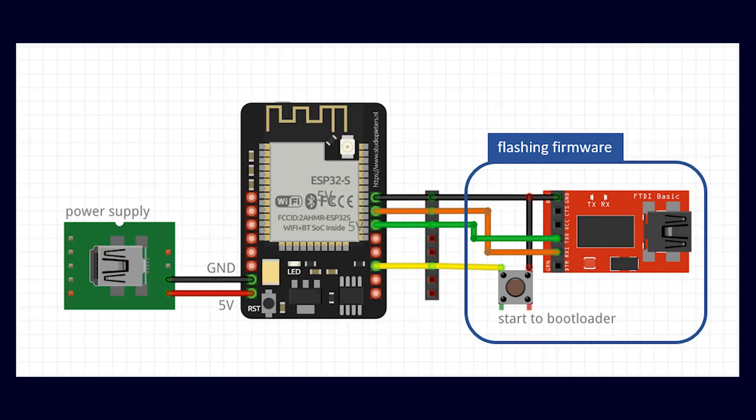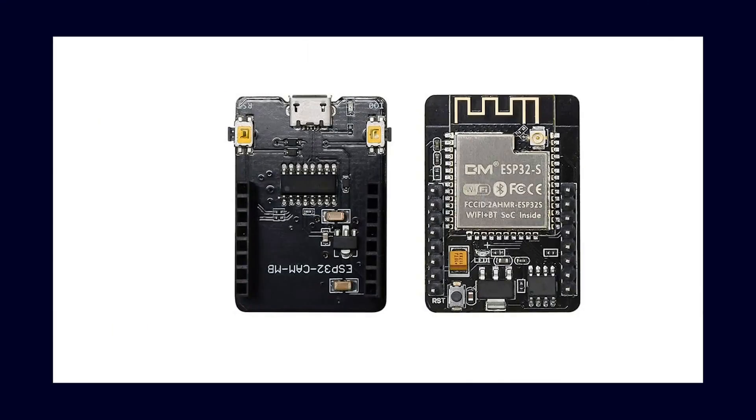What we need for this is the ESP-CAM, which we have also used in some other projects. As you can see here, this is a super small camera that can be connected to the ESP. This is a special board that also has a corresponding connection — I will link it below in the description. You can get a pack of two for around 15 euros, so it's actually quite cheap. However, there is a disadvantage: we do not have a USB port here. To install everything, we need to connect a USB flash adapter. It's easier if you simply order a board that can be plugged onto the pins, giving you a USB port to flash everything.